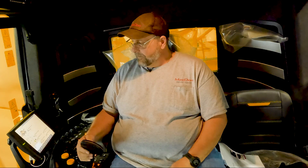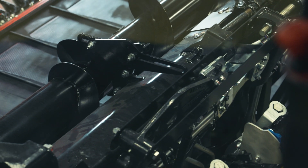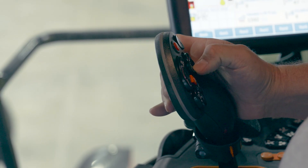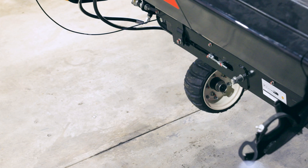When we go back to our run screens — run screen one, two, three, four — there's our belt. Tap on it and you can adjust your speed wherever you want. Now that we've got our monitor configured, we can use our native controls to control our header functions. Header up/down, reel up/down, fore/aft — all the same as they've always been. The shift button on the back of your hydro handle plus fore and aft gives us header tilt, and for the contour max option it's the same shift button but now it's reel up and down — up to raise the wheels, down to lower the wheels. That's all that's required to enable the integrated features on your brand new FD2 and your Case New Holland combine. Thanks for watching.